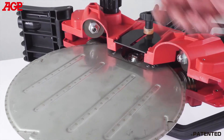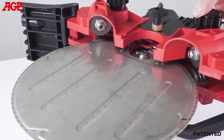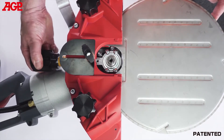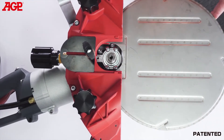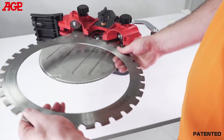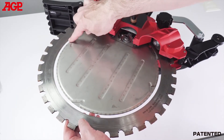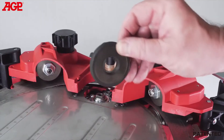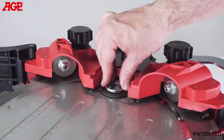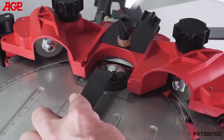To mount and adjust the blade, loosen the thumb screw and slide open the cover plate. Loosen both guide roller adjusters all the way. Slack the drive tension adjuster but leave enough clearance between the drive wheel and the water plate. Fit the blade with the grooves facing down toward the left side guide rollers and engage the grooves. Make sure that the blade is centered — if it is installed crooked, rapid wear will result. Fit the drive wheel onto the spindle with the taper facing out, then the flange, align, and tighten the screw using the face spanner and T-handle wrench.